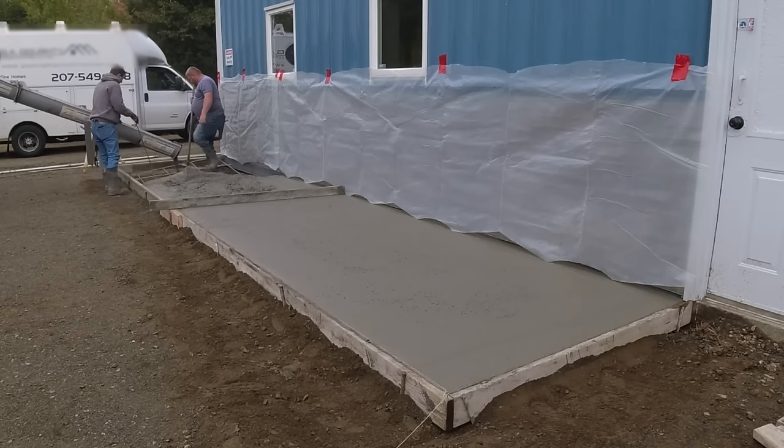You can see the kind of rock face on the side of the building — that's slate or cultured stone or whatever they call it. The release we got sprayed up there will all evaporate and disappear — it doesn't leave a stain. They wanted the stamp concrete to blend with that building a little bit, maybe be a little darker, something that's going to go with the pattern on the wall but not be the exact same pattern. That's why we're using a rock stamp here versus something like an Ashlar slate, which would be a little closer to the same pattern they have on the wall.